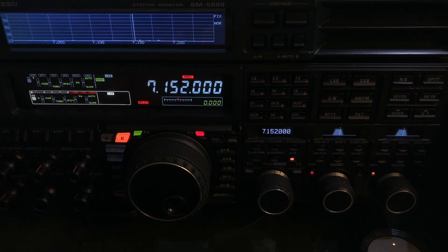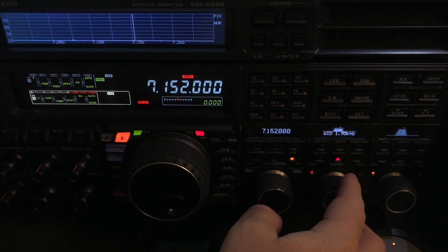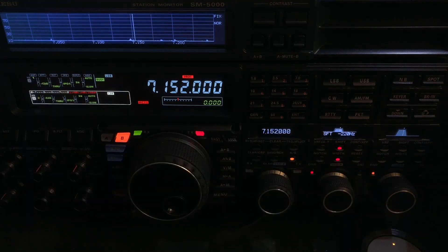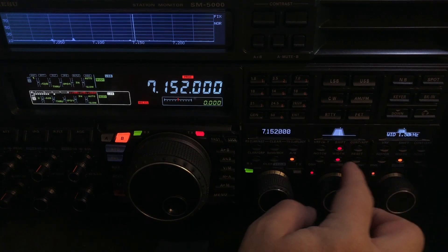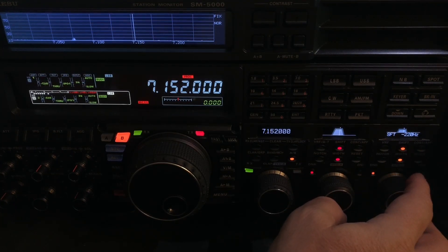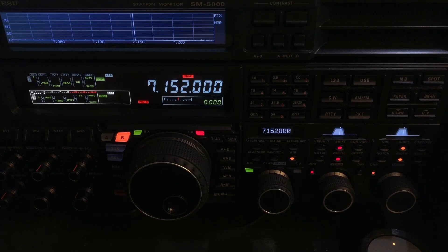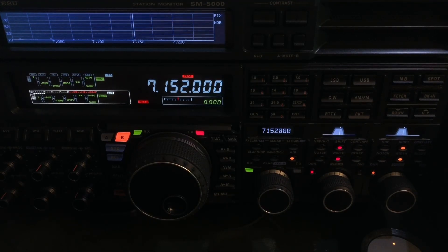So that's what I was dealing with trying to listen to these guys. I'll set my DSP width down to 1.5 — they're only two kilohertz away, so I'm narrowing my bandpass here, and then shift. It looks like negative 220 is doing it. I'll switch on the other receiver, narrow its width — I ended up at 165. So 165 and negative 220 on the shift. Remember: if the noise has that high metallic sound like you're hearing here, you want to use negative shift. If it's a low honking sort of interference, go positive with your shift.